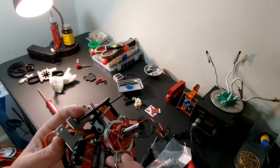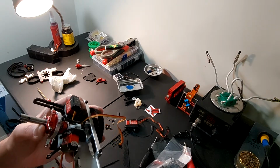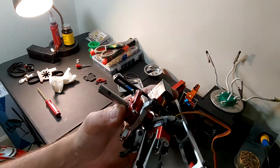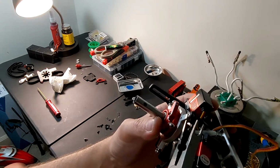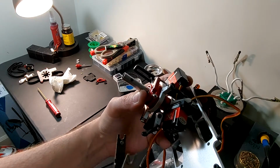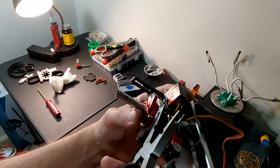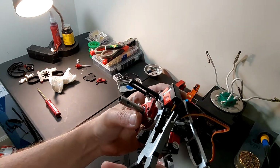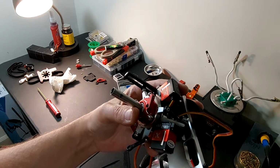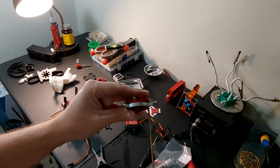So we'll go ahead and pop all these links on. So when you put them on, you just put this side over here, this side over here. You just want to put it behind the ball like that. And then these two prongs will push on it and get it snapped on there. I forgot I had to take the swash plate back off because these all need Loctited.